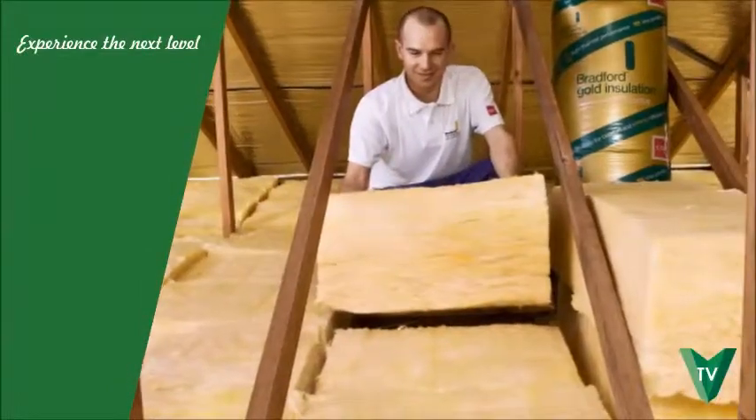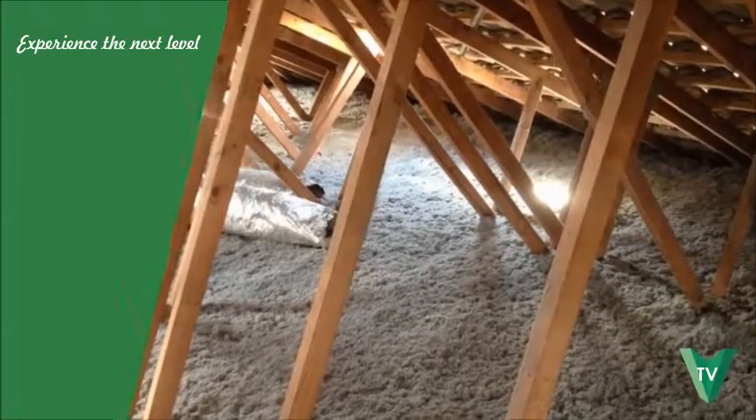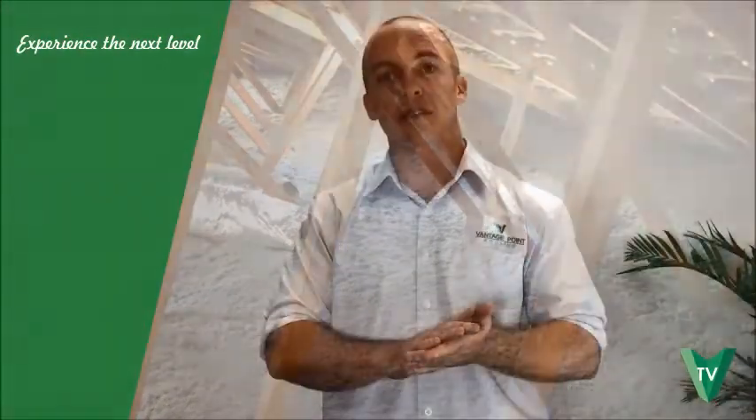That's great — often what they're referring to is ceiling insulation: batts or pump-in paper insulation onto the top of the ceiling. The main difference is you've also got an option to put in a foil-faced glasswool blanket underneath your new roof.